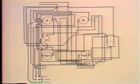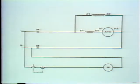Here's another type of diagram of the controller we just saw. It's called a wiring diagram. A wiring diagram shows the physical location of all the components, contactors, resistors, fuses, etc. in the controller. Now, even though these diagrams look totally different, they're exactly the same, electrically speaking. When we're actually working on a controller, we'll use the wiring diagram. But right now, we're going to look at a schematic diagram of a controller. We'll use lots of the symbols we described earlier.